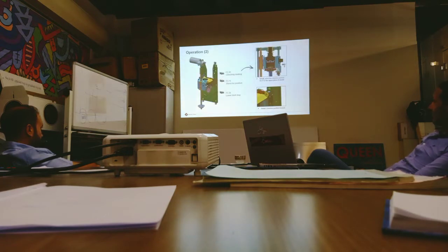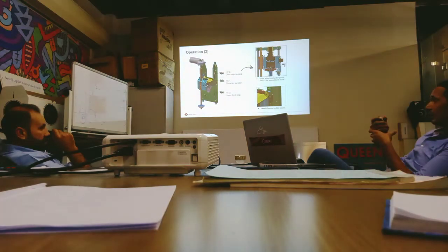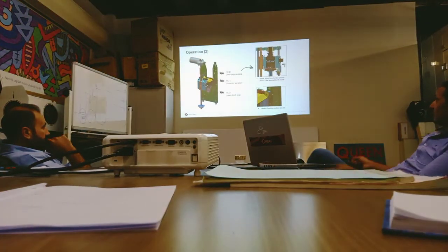I will give you a small exercise to let you understand the cycle of the S20 unit. The S20 unit, as I mentioned, has three photo cells. Remember, FC1 is the standby position, the one in the middle, so the brewing chamber is in position to receive the coffee from behind. Then FC2 is the upper position, where the chamber is closed with the piston. Then FC3 is the lower position limit to throw the coffee cake.